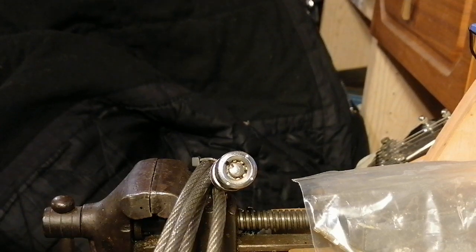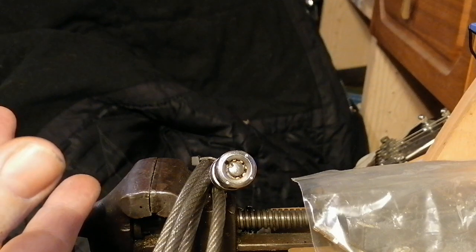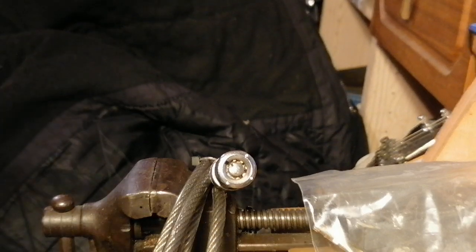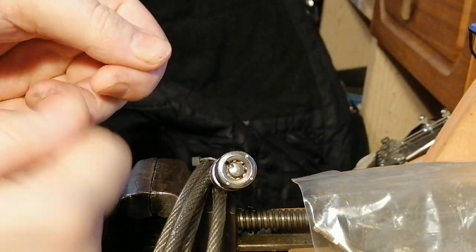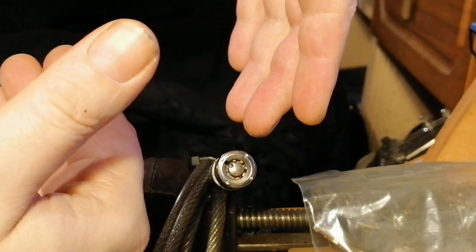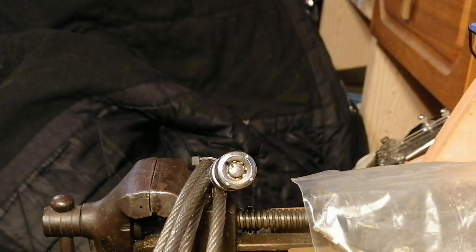When I was looking at this lock for problems, it got me thinking: if those shutters are just on springs, then maybe I can wrap those springs back. So the idea is I tap it — not hard, tap it gently — however much force it needs — in order to bounce those springs back and just take the lock off.